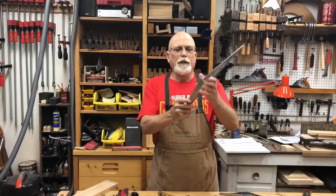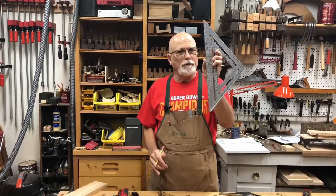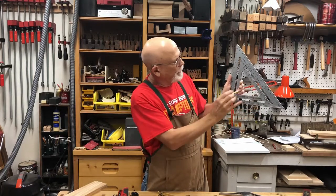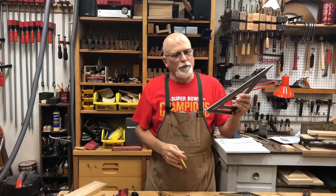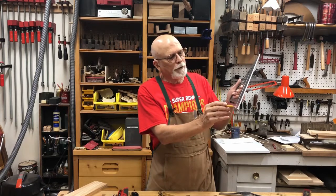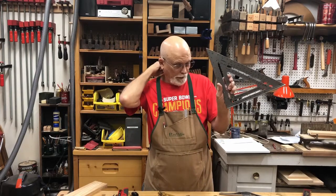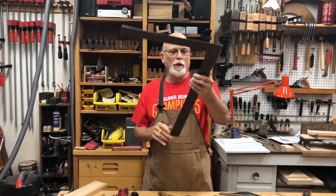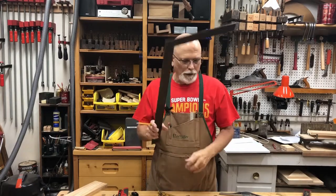Then you've got bigger squares like this — it's got a lip on it that you put against the board to mark it. It's got different angles; you can start from one point and mark angles as you go out. This is in half-degree increments or one-degree increments all the way up, so you can use this as a compass. There's also these squares for bigger things to mark, and these have useful information for construction — rafter and stair information — same as the other one.